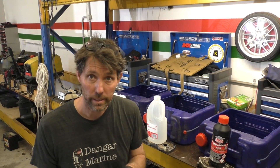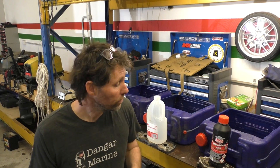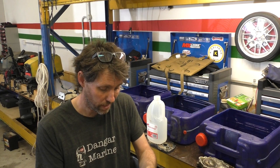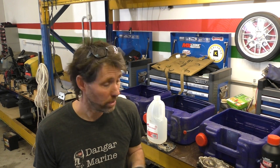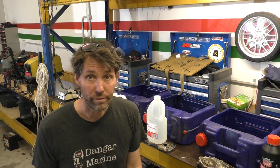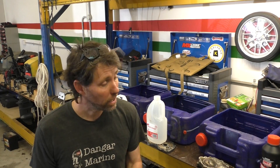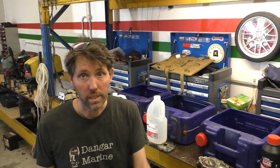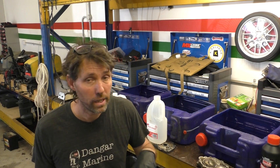I've got three tubs with 10 litres of water in each, so I'll just add a recommended ratio of each product and then get them soaking. For the hydrochloric acid, it recommends 10 to 1 for cleaning brickwork, but maybe that's a bit much — I really don't want to cook this aluminium. It's scrap metal, but I can't say I'm confident about what I'd ultimately put through a functioning outboard. So I'm going to go 20 to 1 — half a litre into 10 litres.